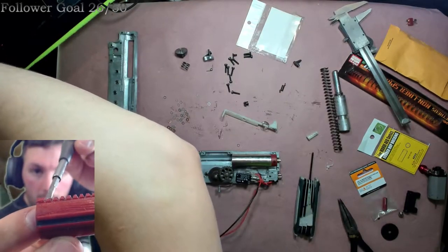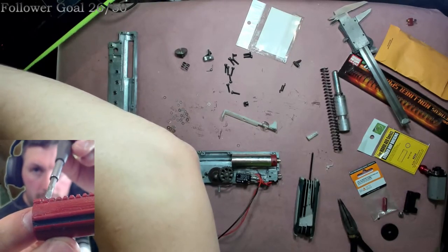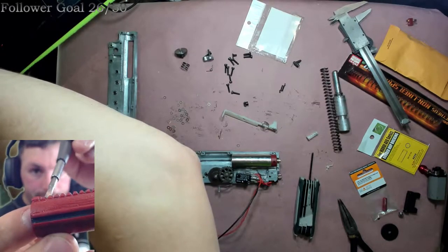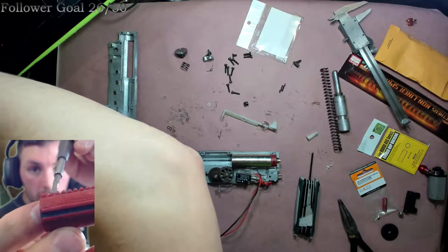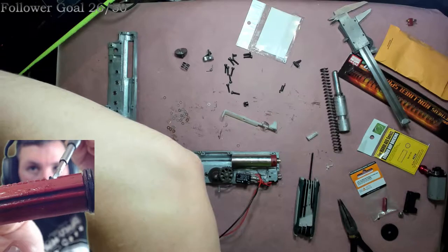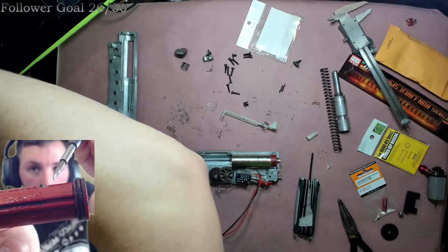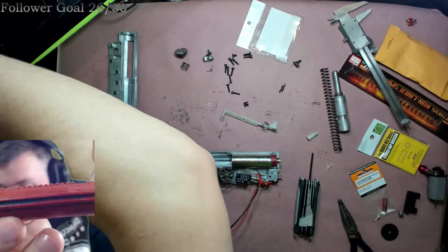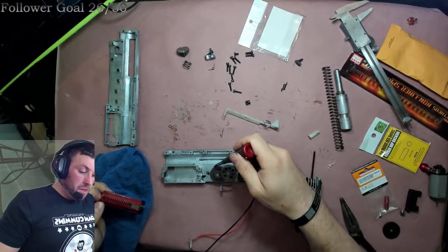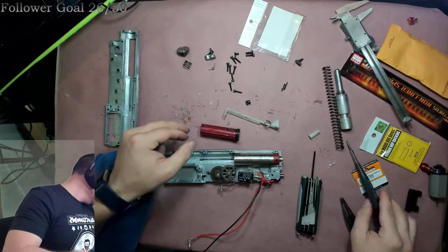a little bit. They did that out of the factory because what ends up happening is the first tooth on the sector gear, if it picks up this one, it'll pull all of these and then it'll release it on this one. But there'll still be one more tooth on the sector gear. And then it'll push forward, and then the next gear will pick it up on this metal gear. And that will cause these teeth right here on the outside teeth on the spur gear, those will shear.